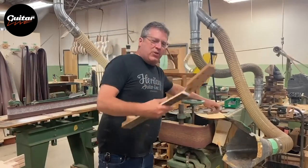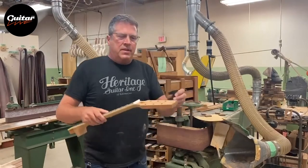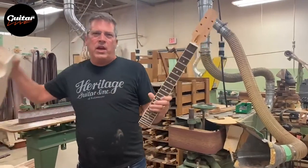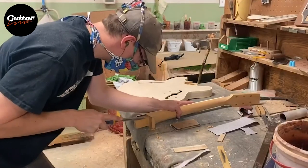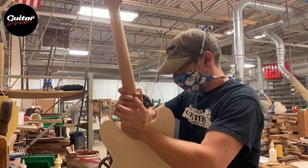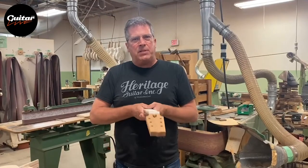We've done a little bit of measuring as well. We have certain shapes that we like to keep here — certain depths and widths. The headstock needs to be a certain width and depth to hold the tuning pieces. They also fit the necks here using a chisel and a multitude of gauges. The pins touch the fingerboard, and the last pin touches the top of the body ensuring that the neck is set at a particular pitch. Not only do these necks have to go into the body straight, but they need to be on a particular pitch as well.